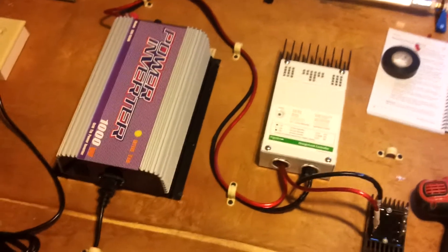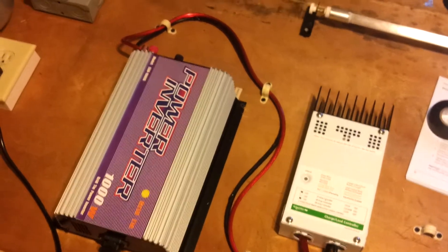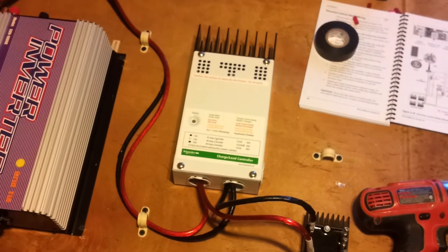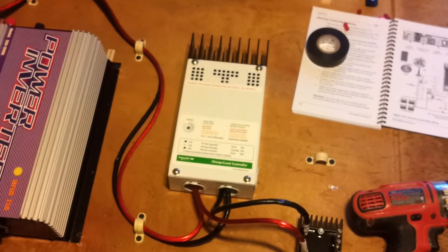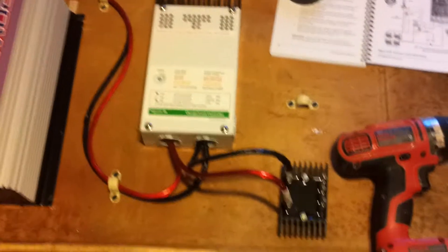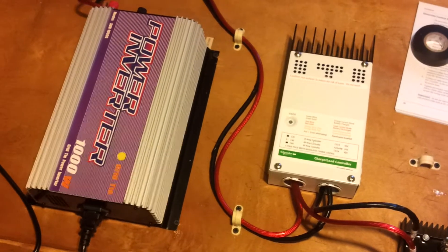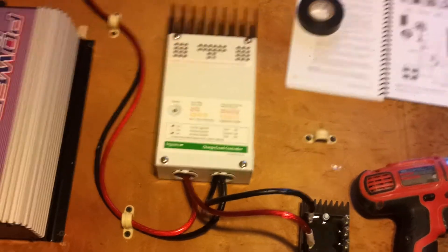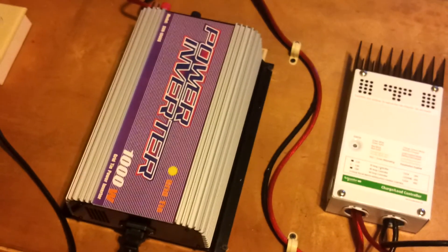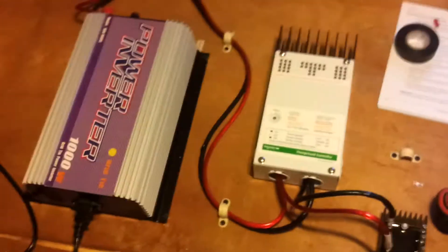Since these Sun G 22 to 60 volt inverters seem to blow up when they dump — at least when you exceed 100 volts — I'm going to try running a Xantrex C40 as a diversion controller. It will dump to a 3-ohm 1500-watt resistor. The C40 is going to be paralleled in with the grid-tie inverter, and I have the dump load set at about 56 volts, which is just under the 60-volt maximum before it dumps. There's nothing hooked up to its dump load, so basically I'm just going to use the C40 as a dump loader to protect the grid-tie inverter.